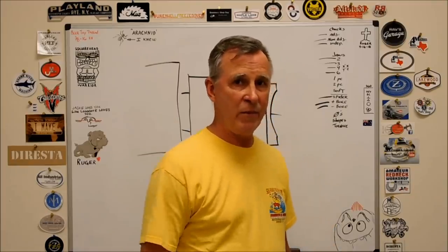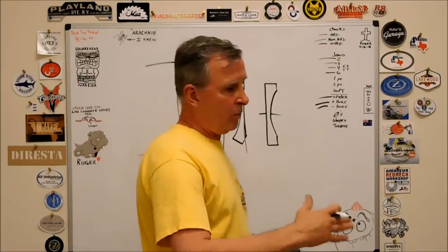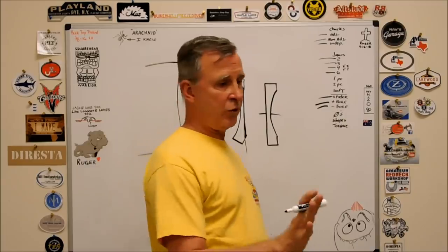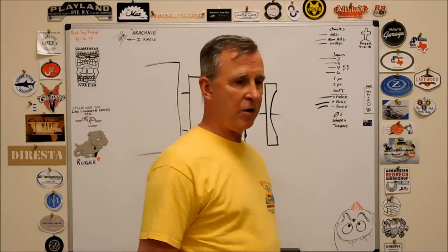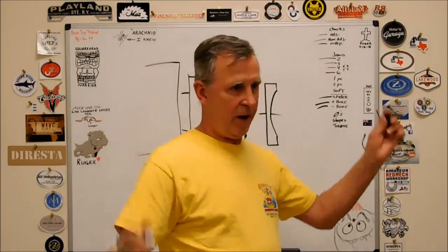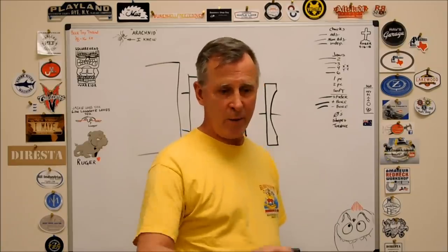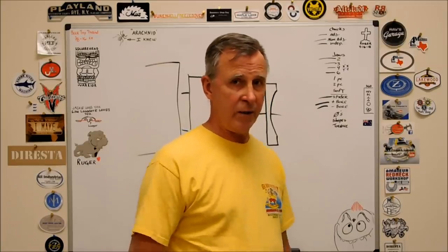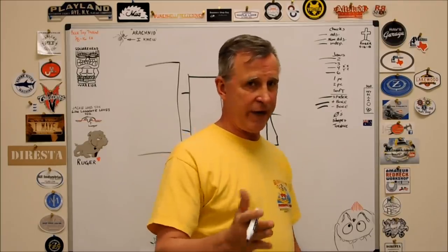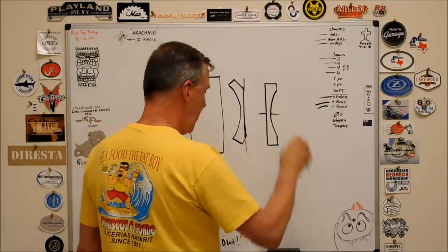See what happened? It torqued it too hard. This will happen in a fashion with a three-jaw chuck that you will not believe. Some corners will go in, some will pop out, the center will bulge, and when you're done with it, you put the indicator on it, and there's no rhyme or reason to exactly what's going on with that indicator when you run it across it, because there's no constant. Some are down, some are up, some are dish, some are bulge. It'll make you nuts. Do not squeeze it too tight.